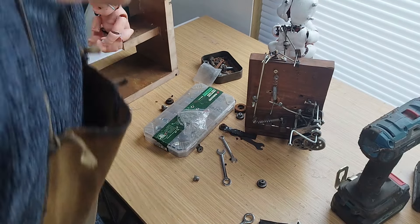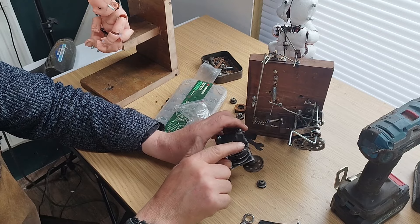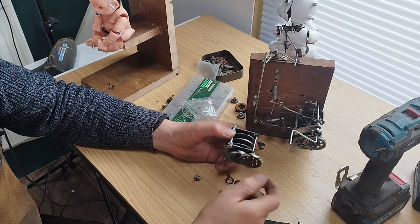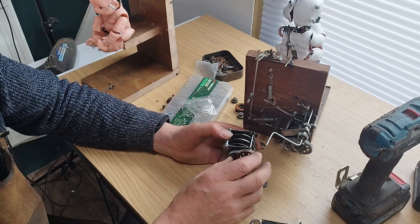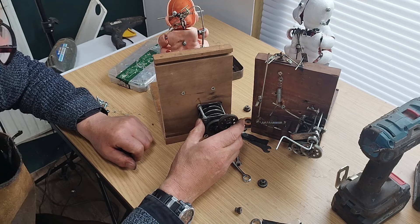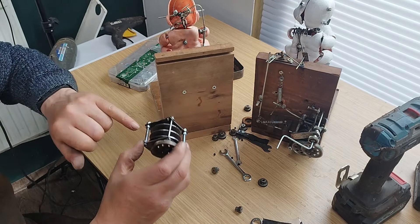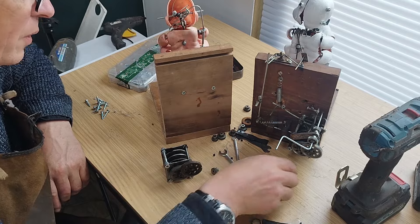So what I've just done is drilled the holes, put this rod through here and then put a nut, a washer and a nut on, and then welded the end of the nut so now when you turn it, it turns quite nicely. I'm not going to add the handle and these extra bits until the whole thing is mounted. I'll carry on adding everything, testing it, then at the last minute add on the handle. So next, the job is to mount this here somewhere - which I think is just basically some 4mm bolts and nuts that run the other side, and should just be able to get some 4mm nuts on the other side that won't hit this plate - they haven't on the other one.